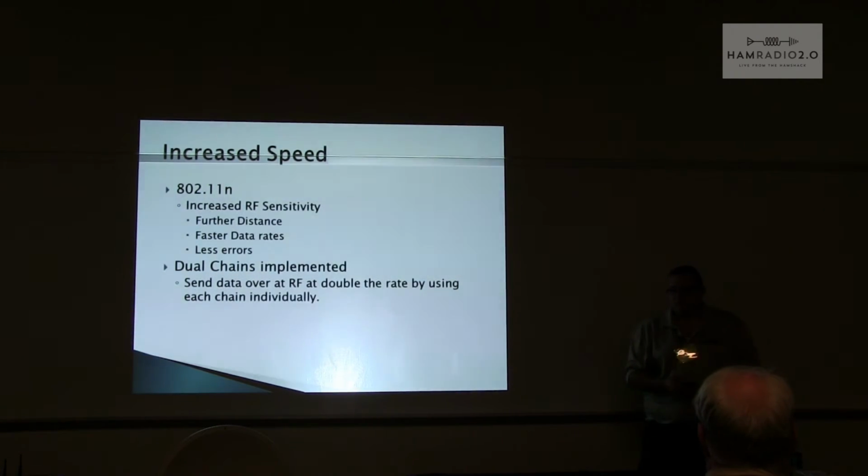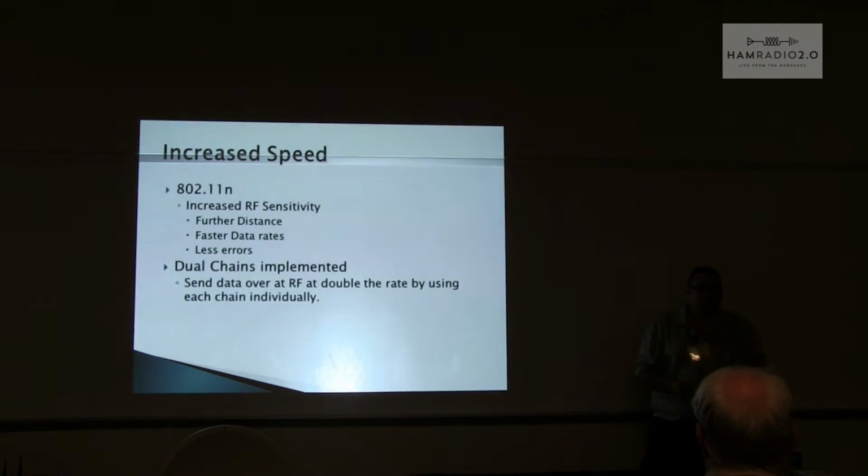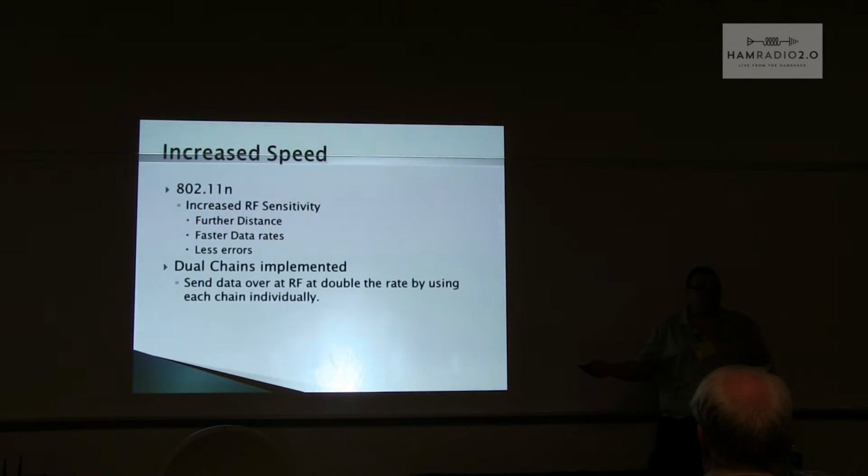A bullet, which a lot of us thought were going to be our go-to devices originally, they're single chain, single polarity. We're finding that that lack of diversity actually hurts the device. So bullets are not actually most of our favorites anymore. The nanostation tends to be our go-to device. Even though you can get an air grid for a bullet at 24 dB, we can find a nanostation with 11 dB can actually perform better because of that second polarity.